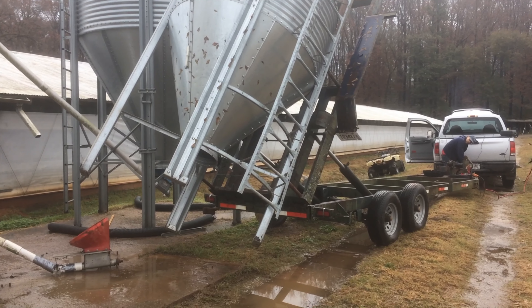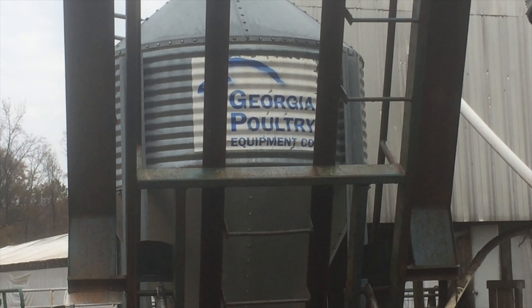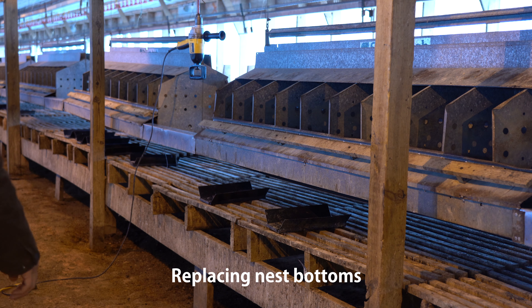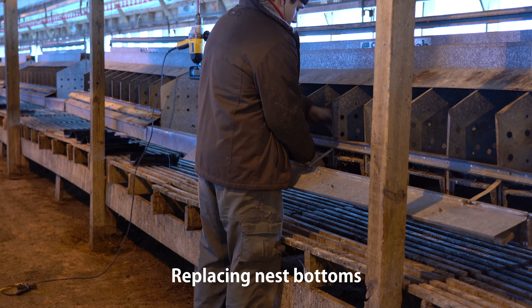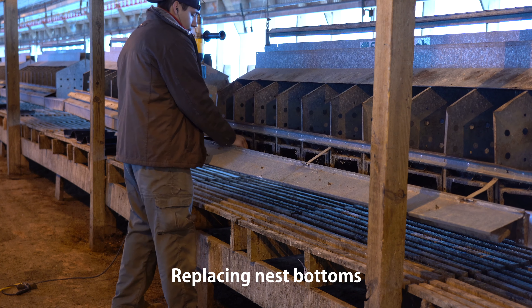This year we also replaced the rooster feeder bin located on the outside of the chicken house — the old one had become rusty and full of holes. We conducted a lot of repair jobs this year, though unfortunately I didn't record all of it. We replaced a lot of the drinking water lines and chicken feeder lines, both of which are pretty difficult and complex jobs. We also repaired a lot of the chicken nests, replacing the nest bottoms, side panels, and the egg belts for the entire right side. Each of the two egg belts on the right side is a thousand feet long, installed through the nests. We did those nest repairs while the egg nests were floating up in the air, which is much easier than working on them when they're on the ground being used by the chickens.